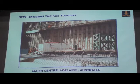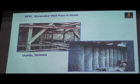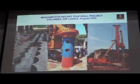This is another project in Australia, a big area excavation with a secant pile wall, and they use the anchor. In Taiwan, because of the space, we don't have space for anchors, so we use internal structure. And Cambodia, similar, a strong secant pile wall. In 2005, I think this was the first project in Sri Lanka with a secant pile wall, and nowadays it's nearly the standard retaining structure in Sri Lanka.